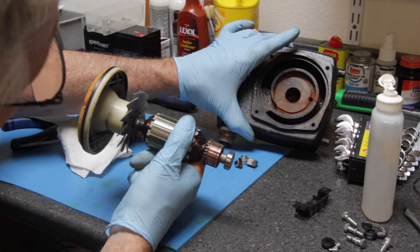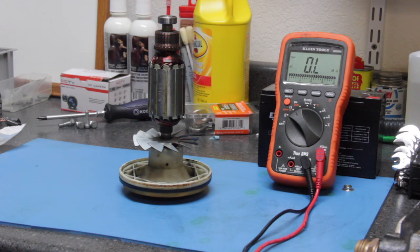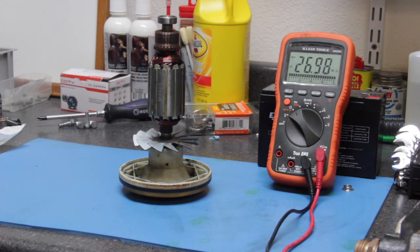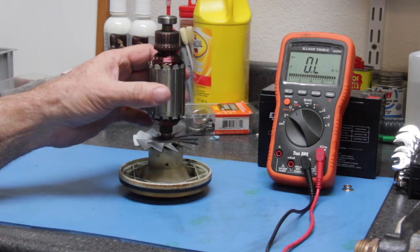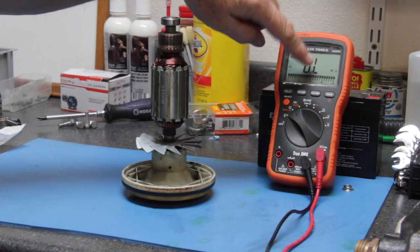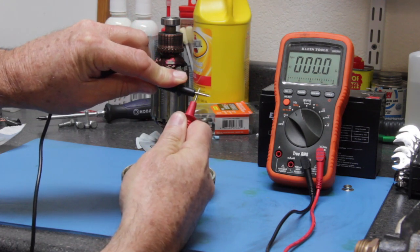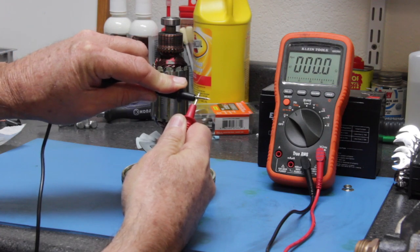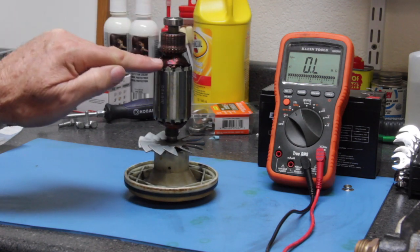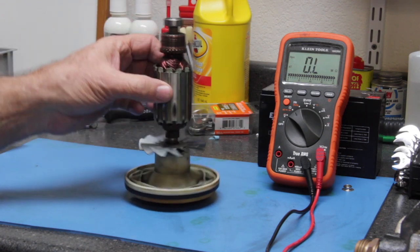This goes into your pump right here. Now that we've cleaned up the commutator, we're going to take our ohm meter and test the armature to make sure it's functioning properly. There are basically four tests by the textbook that you can perform when testing an armature. You want to have your meter set on ohms. Notice the OL — that's the open loop. Continuity means it reads zero, which is a hundred percent continuity. We're trying to test that the commutator is connected properly to all of the copper windings that wrap around the outside of the armature.